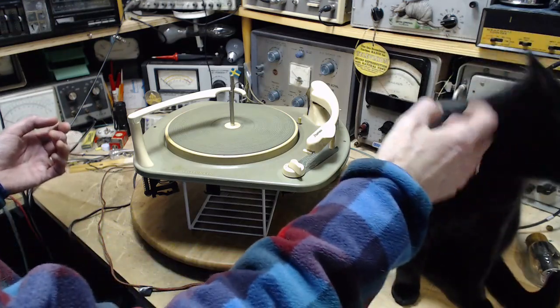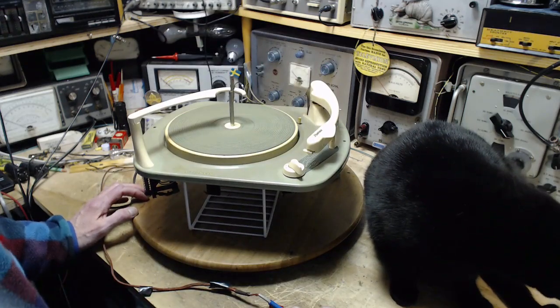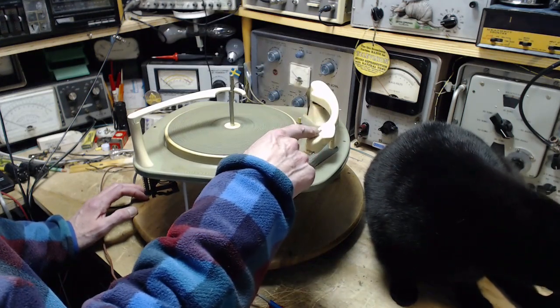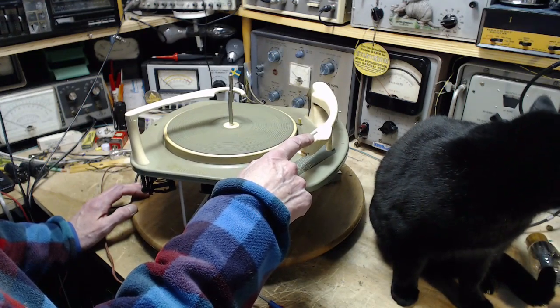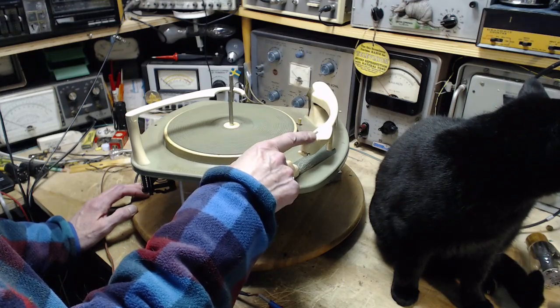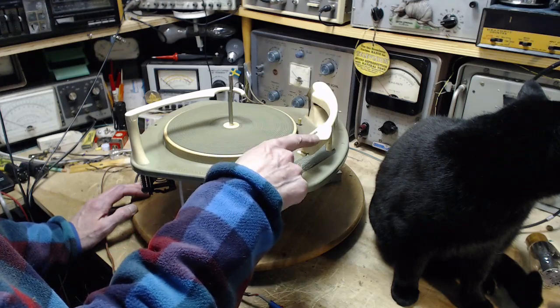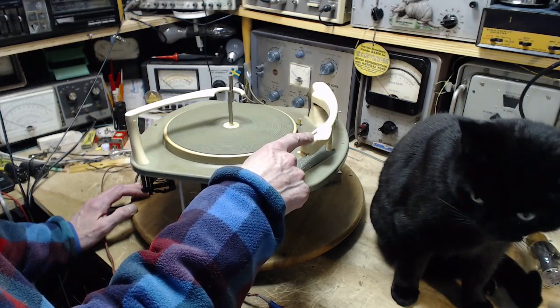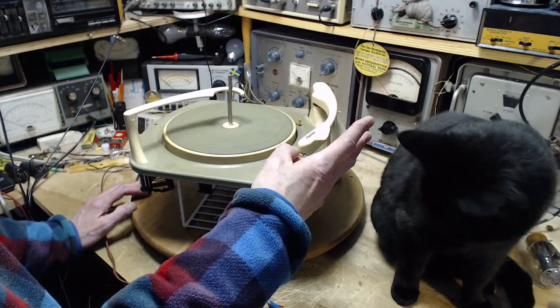Seems kind of counterproductive. Why not just do a mono thing all the way here? But that wouldn't be stereo ready. If you short these together so the two channels are now one channel, it's no longer stereo ready. So what makes it stereo ready is if you send one channel from here down to the console and the other pair out to the back to some terminals on the back.